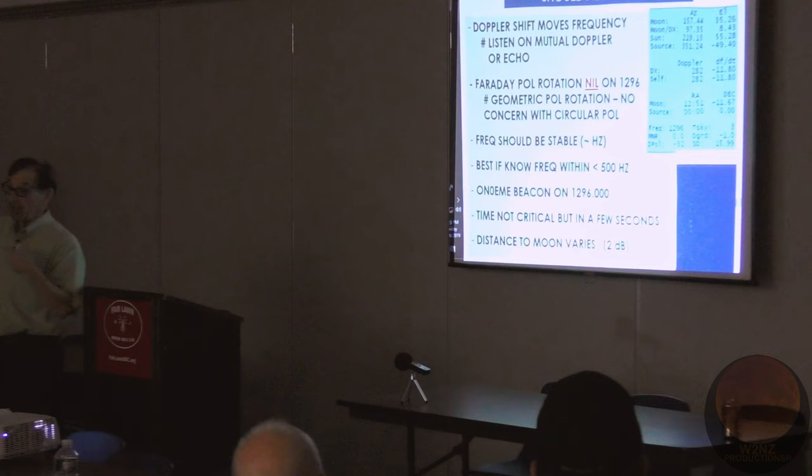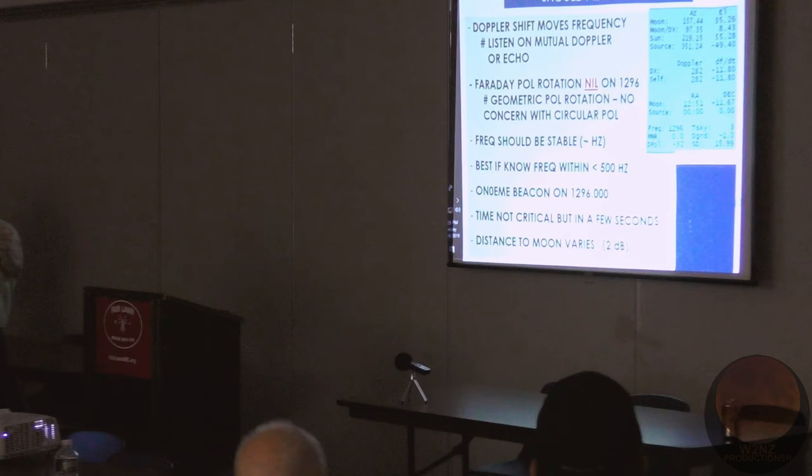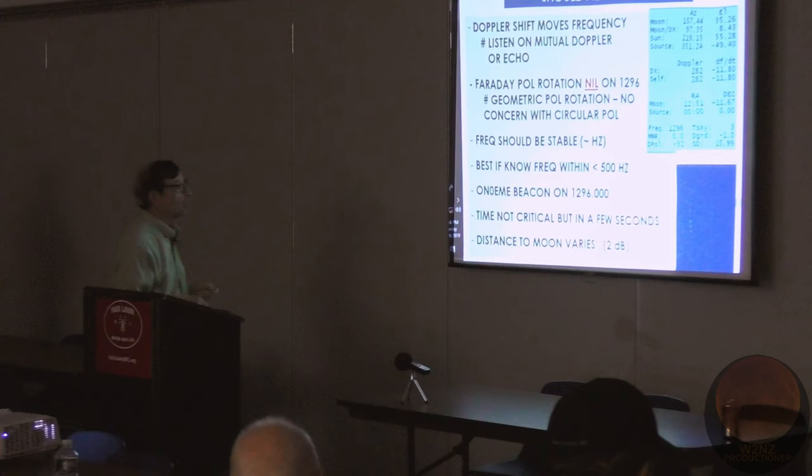Let's say I'm working a station on this way on the horizon. So I'm working, let's say, a station in Europe. The station in Europe is going to have the moon moving away from him. The frequency is going to be going down. You're going to have the moon moving towards you. Frequency is going up. The Doppler you hear, and he hears on you, by the way, is the combination of those two. So what you need to know is what the mutual Doppler is.